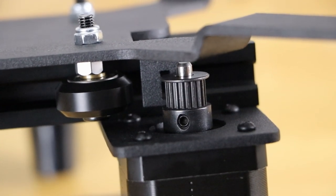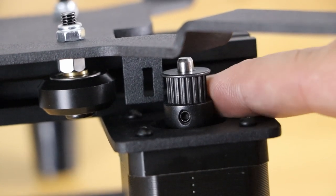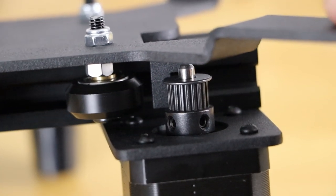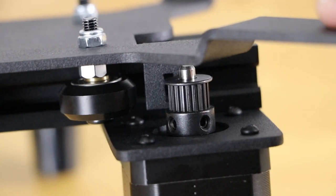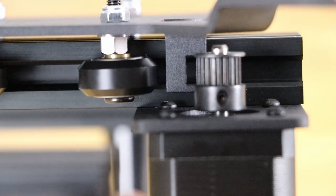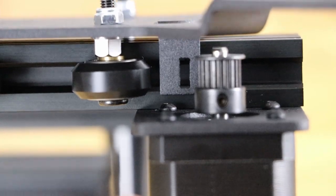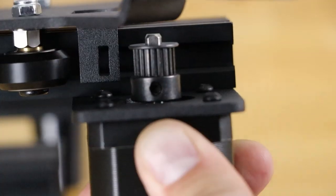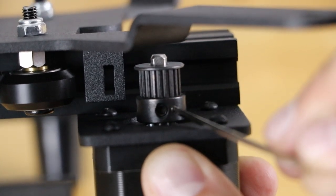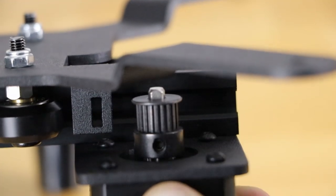Mine's a little bit low on the gear side. We're going to loosen the grub screws here just a little, raise it up and make sure it's even. You want to make sure it is even back there — not above or below. I got it adjusted and as I bring it through it is just about perfect, just in line with that grub screw — that's exactly what you need. When you tighten the grub screws and get it lined up, make sure one of them is on the flat spot so it won't move later — get them good and tight.